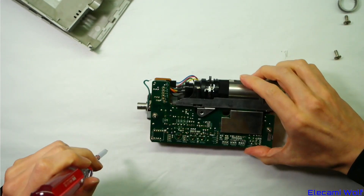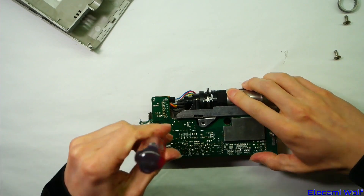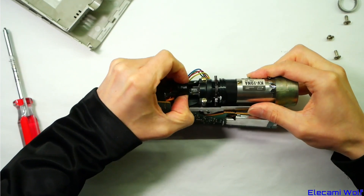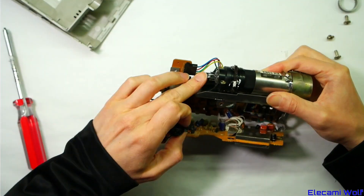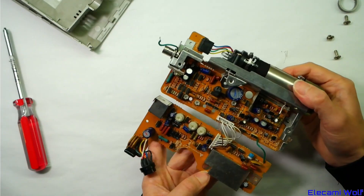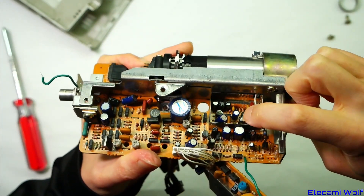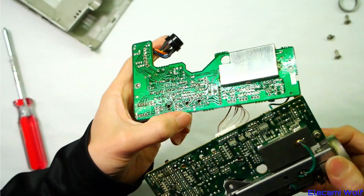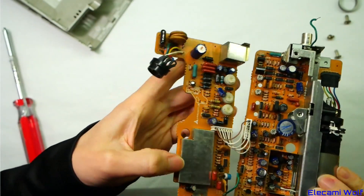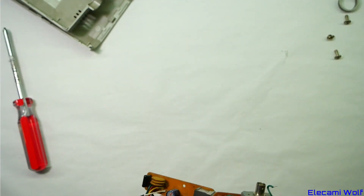Let's take these boards off and have a look. There's shielded boxes on both sides. I'm going to unplug the tube off of that - it's like a little valve socket. You can see the end there where they've sucked the air out. No integrated circuits as I can see. So that there must be the signal that comes off the tube, off the front, and then there'll be some careful low noise amplifiers there. The trimpots you can access from the bottom - there's a little hole there and another screw head on the bottom, so you can have it all assembled when you set it up by putting your adjustment tool down there. Smells a bit like capacitors are going bad.